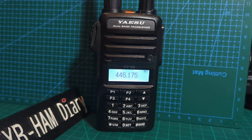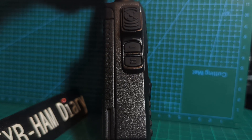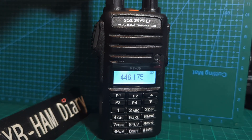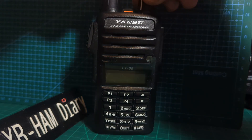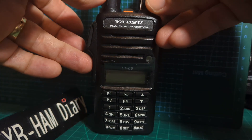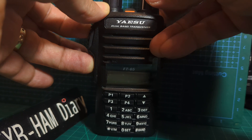There is a thing here where you can enter a number to make it transmit outside of a certain band. I don't recommend you do this, but for information purposes I'm going to show you. All you do is turn the radio off, hold down the button under the PTT — the one marked with one line — then the PTT, and turn it back on.